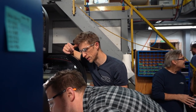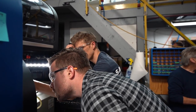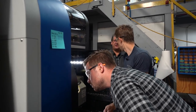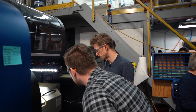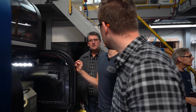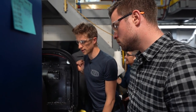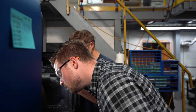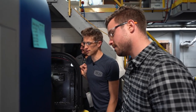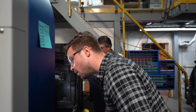Yeah, so I've got the 2000 PSI high pressure coolant with lines going to the drills. These lines here go into the turning tools. There's a suppression system on here too, right? There is fire suppression. If you run oil, you need fire suppression. Okay. It was not that expensive. $1,000 or something? It's in the quote. Okay. It's in the quote, yeah. And thankfully, I haven't had to use it yet. I have seen something spark up when I ran titanium with no coolant. So I was like, oh my gosh. But yeah.